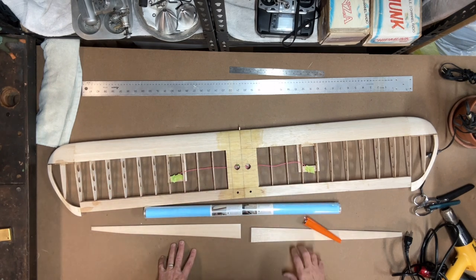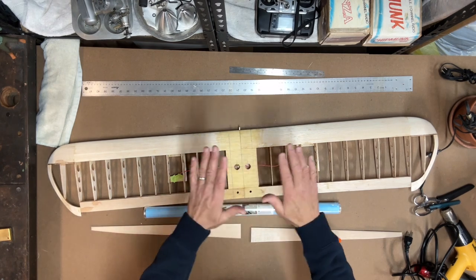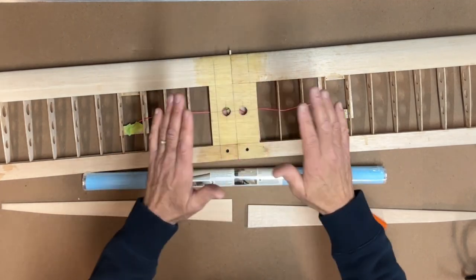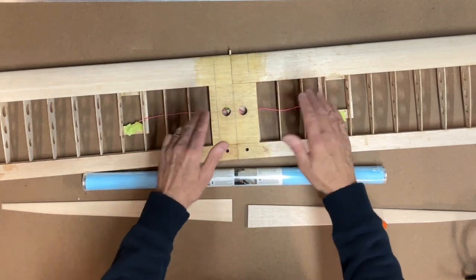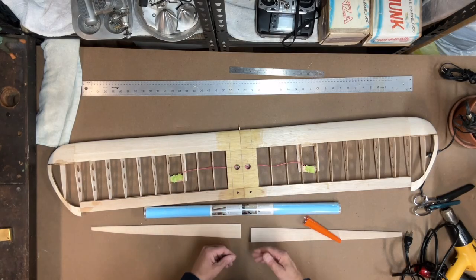But one thing to keep in mind, something I wanted to point out now, is that it works really well when it's covering down around something. For example, if you're covering on an outside curve, or an outside angle, it goes over the top of it and shrinks down onto it, and it works really well. The opposite is a little more difficult.